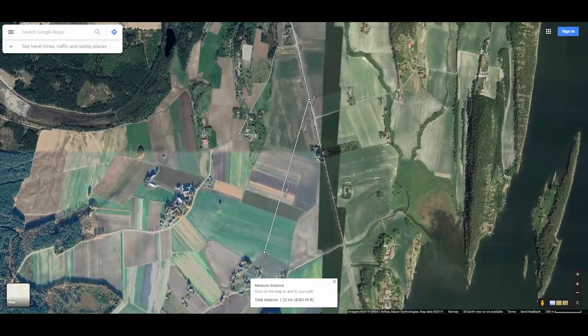All this was achieved with just using the spring antenna on the sender. Now we had passed the 1k mark, so we decided to use the best performing antenna on the sender as well. CONTACT! With this antenna on both the sender and receiver, Mike kept on walking. At 1.76km we ran out of free line of sight, so the signal dropped. That's about the 1.8k promised in the datasheet. We made it!